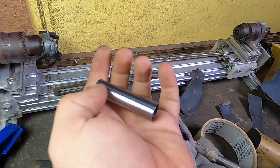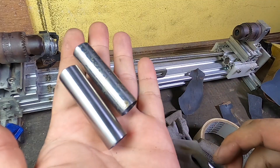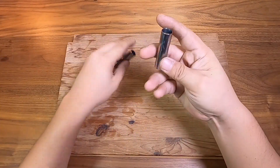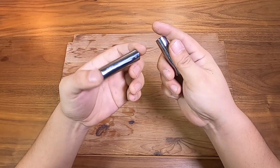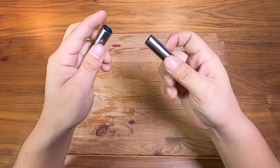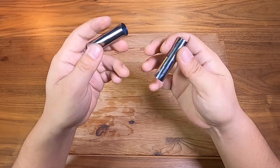So it's nice and clean guys — all silver and shiny, got two done here, just need to clean them off. If you look at these tubes after I've sanded them from about 100 grit all the way to 2000 grit, then polished with a metal polish, they come out quite clean and satin.